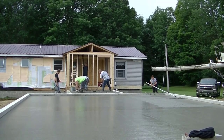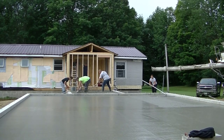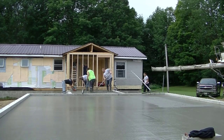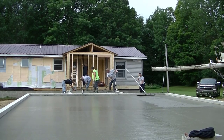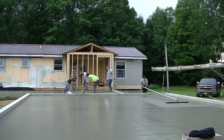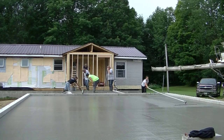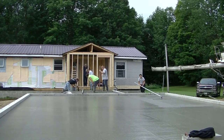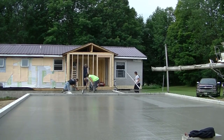Tia's finishing up bull floating that bay. All the tools we use — the bull float, the rakes, the screeds, the mag floats — are available down in the description below if you want to check them out. That's basically how we pour a 30 by 40 garage slab with a slope to it — a three inch slope so any water that drips off the cars will run towards the doors and out. Then we finish up that little breezeway slab, screed it, bull float it out, and we're done. We'll leave a couple guys here to power trowel it nice and smooth, then they'll saw cut some contraction joints, and then this floor will be all done for today.